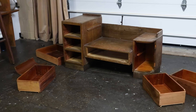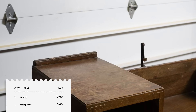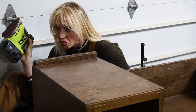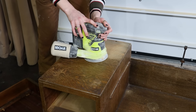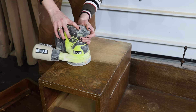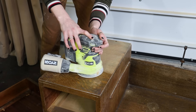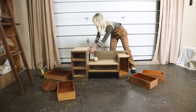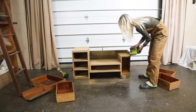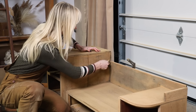Now that our vanity is all in pieces and upon some further inspection, I've decided to just go straight in with sanding. I'm first going to go in with a 100-grit sandpaper to start, and I'm not going to use anything lower than this just to not risk sanding through the veneer. A few important things to keep in mind when sanding wood is to always sand in the direction of the wood grain — this is going to help avoid damaging wood fibers as well as maintain the appearance of the grain and keep it beautiful. And to get any nooks and corners, I'm just going in with a folded piece of sandpaper and getting those by hand.